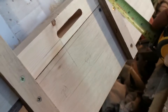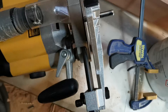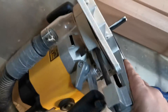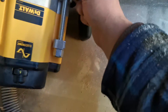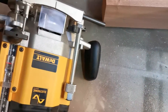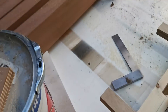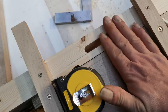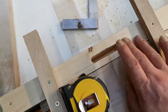It just poked its way through this timber — I felt it go through, and that's 70mm. So how am I missing 5mm? This thing is at least 100mm — I wonder if I could undo that and wind that out 5mm. That would let me stick the cutter out, because at the moment I've got the cutter just flush with the base, just a fraction back, so when I put the machine down the base is sitting and the cutter isn't protruding. But even then I'd still only get 75mm depth.